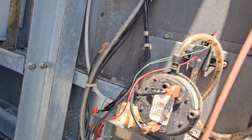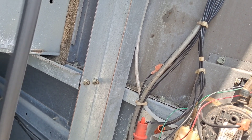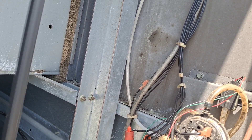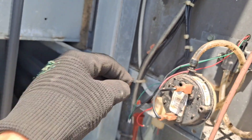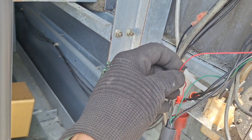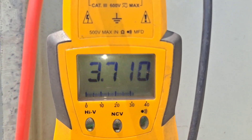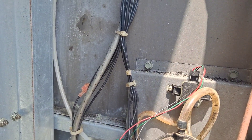Alright, so I disconnected the red wire from the transducer and I'm literally just measuring the voltage coming from the RTAM board, tied on with green which is your common and red which is your output voltage. You can see I got good voltage. Now I'm going to touch the red wire to the five volts coming from the RTAM, and you can see what happens - it is dragging down the voltage, which means that that transducer is the problem.